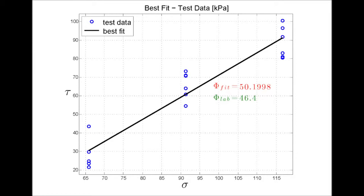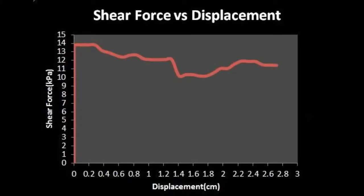After several tests at various loads, we can graph a trend line, which we can use to infer the cohesion and friction angle of the regolith simulant sample. In addition, we measure the force output variance with the actuator's displacement, which shows that the force peaks before the actuator begins to move — as expected from a frictional material following a plastic model, as is the case with granular materials.